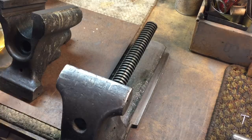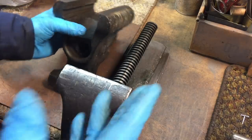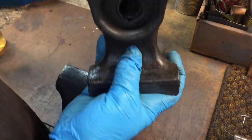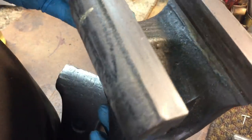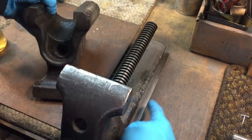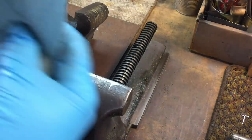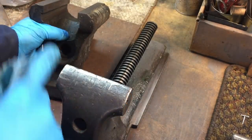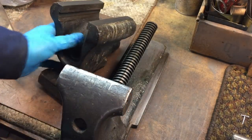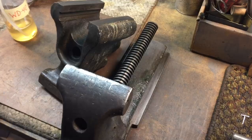I've got to do a little shop maintenance. Every couple of months I take great-grandpa's vice apart and lubricate it. I use this all the time. Look at this massive piece of wrought iron — this is such a great vice. You see over here the rails — this is what it runs on. So you've got to take some WD-40 and wipe this down, make sure you get all the crud off because that's what it rides back and forth on. Then I use my 50/50 grease and straight dirty motor oil, lube everything up, and run it back and forth. I do that every few months.